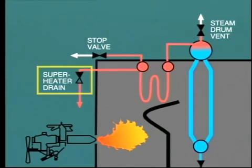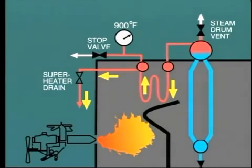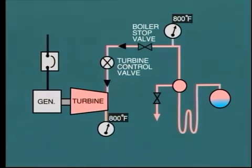Actually, the opening of these valves has some influence on the steam temperature at the superheater outlet. How is this? Well, if the steam flow through the superheater is increased by increased opening of drain valves, then the rate of firing will need to be increased so as to continue pressure raising. This results in a greater volume of combustion gas passing over the superheater, consequently transferring more heat to the steam, so raising its temperature. This maneuver is sometimes employed when we are trying to match steam temperature to the steam turbine metal temperature during a unit hot startup.